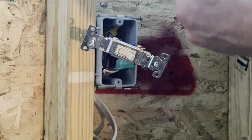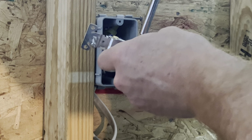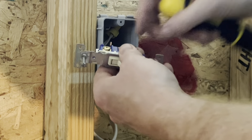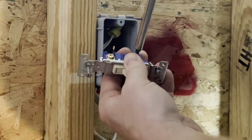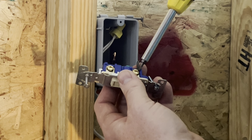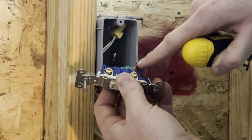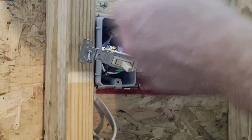Back it off just a little bit more. Beautiful. Now tighten her up. Notice the direction of the hook goes this way, that way you tighten it. And you got just enough copper here coming off the bottom of the screw on both sides. You don't have a lot coming out to back where it's exposed. You don't want that. So that turned out pretty good.